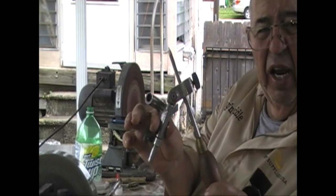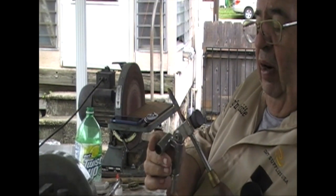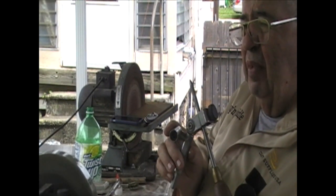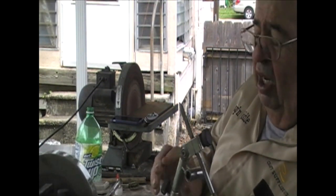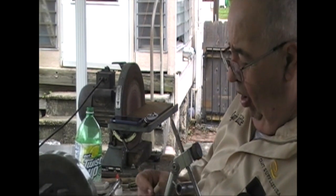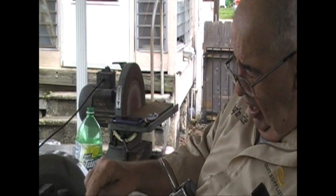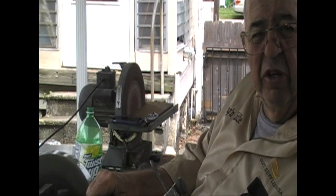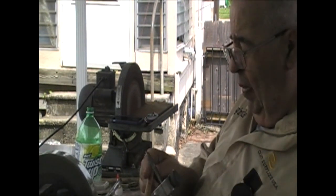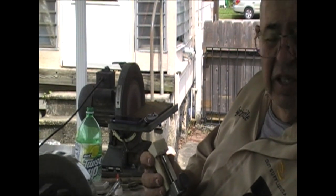The setting, there's a jig. See this jig? They give you this jig with the machine. It's even got the name on it, Tormek. This is set up so you can adjust it for gouges, carving tools, turning tools. It's awesome. I cheated. I made a little set of bars to tell me how far out from that platform this bar would be when I'm using it. It's real cheap, because that's my Ellsworth gouge. So I put the Ellsworth in this, and did my little setback thing to get the distance off the tip.